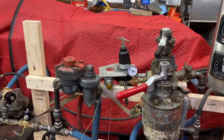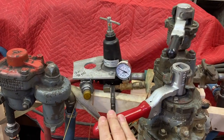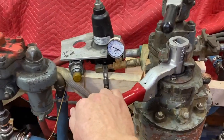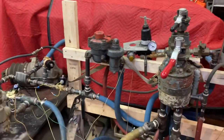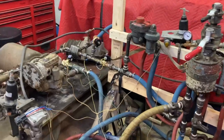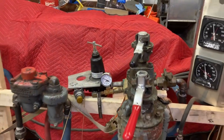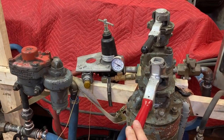The way the 14EL system was designed originally was if it was in the running position and had an undesired emergency — a car separation, anything like that — you literally had to take the handle and put it in lap for it to stop blowing down your system. It did not have a brake pipe cutoff or a main res cutoff system. There's no lockout or lockover system for it at all. So I had to come up with something. Putting a dead man in means it'll blow down the brake pipe, but if you're incapacitated, how are you going to move the handle to lap? And if you move it to lap, it stops everything.